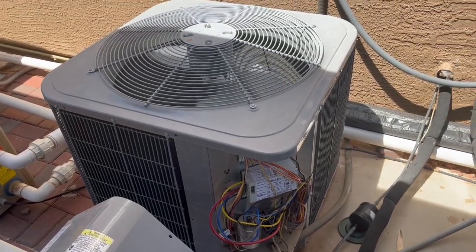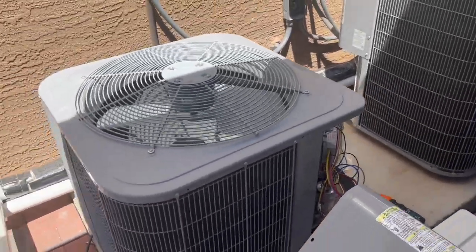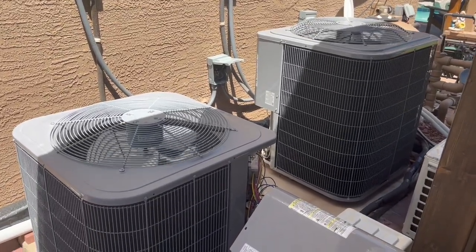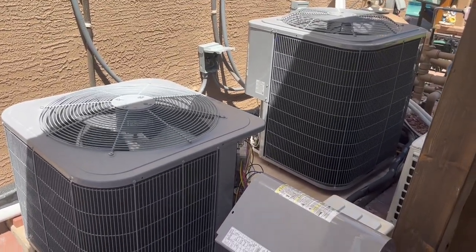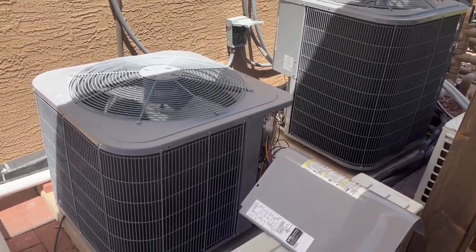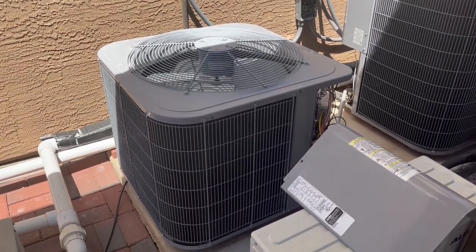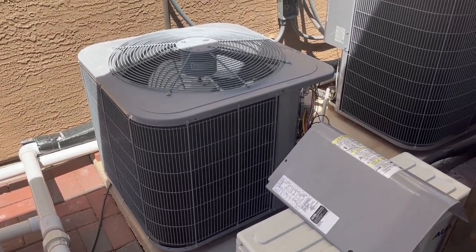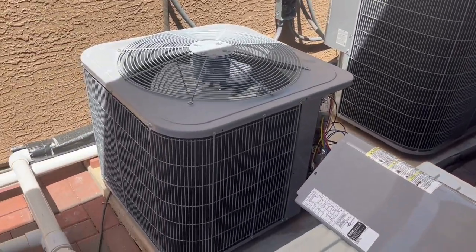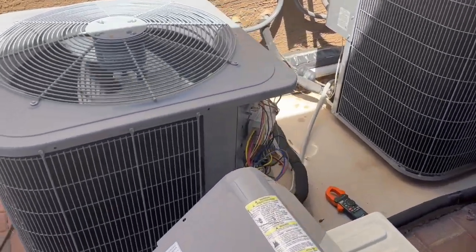We're not having any problems with it, and I can't believe with these 2 Growatt, 6 kilowatt and 12 kilowatt, we have one each running our main air conditioners, and we'll be able to run these from sun up to sundown, because like I said, the inrush on this was 72 to 75 amps, and I was able to start both of these air conditioners with that 12 kilowatt, but I couldn't start either one with a 6 kilowatt. That's why I needed this soft start.